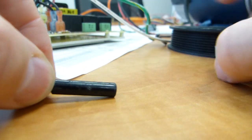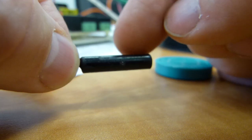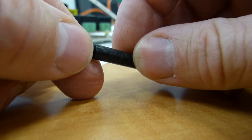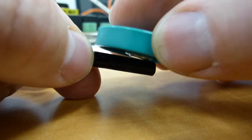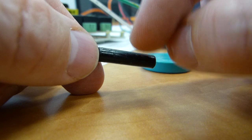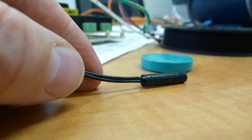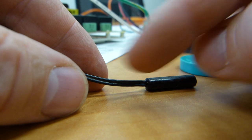So as the magnet on this flywheel passes by this coil of wires here, which is the sensor, the wire itself is made of a metal, maybe copper if it's a cheap sensor, maybe some other alloys of exotic metals. So this magnet passing by, the magnetic field on the magnet is able to rip out some of the electrons on the copper, on the conductor, on the wire, on the coils, and is able to move the electrons up the wire. This magnetic force moves some of the electrons. That means that this generates a little bit of electricity.